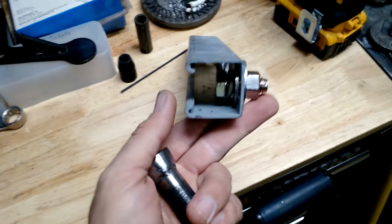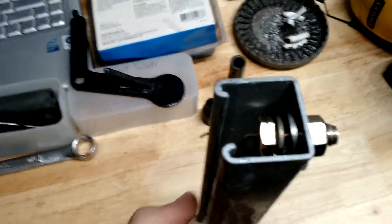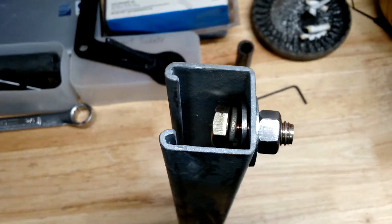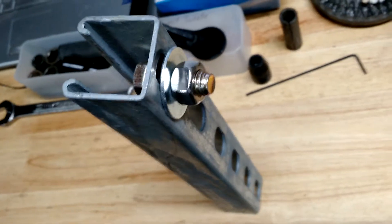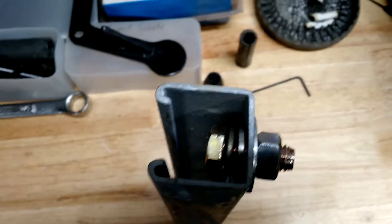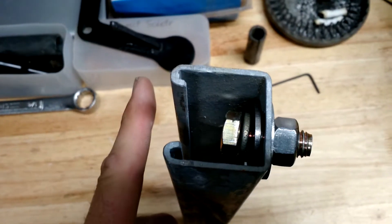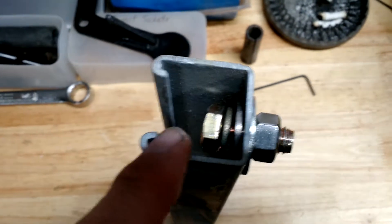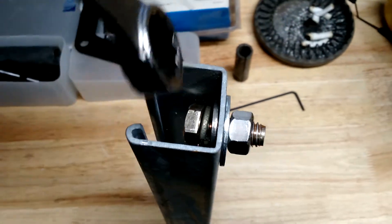I'm an electrician by trade, and we do a lot of things with Unistrut. Between the customers that we have and the hardware we get sent out, we usually end up with half-inch hardware, which works out good with slotted strut, but if you have to bolt it through like this versus coming up top and having a square washer, you can't get a wrench in there if you're on anything but the end. And even when you get a wrench on the end, you can get like maybe an eighth of a turn and you're boxed in.